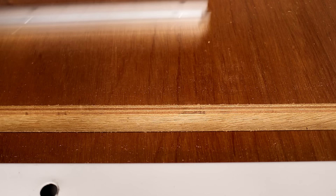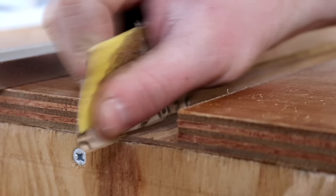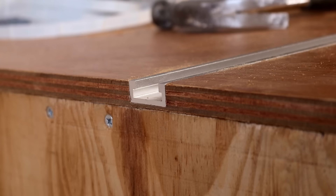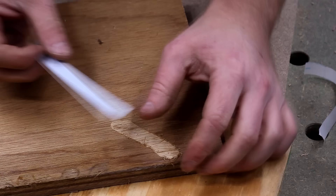That gave me a perfect fit and I did a little sanding just to clean up the cuts. I also wanted to cut a really shallow groove for the tape measure. After setting the cutting depth and trying it out on a test piece I managed to get it set so that it was sitting just a fraction beneath the surface of the ply — which is just what I wanted.